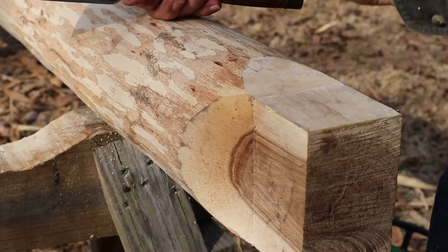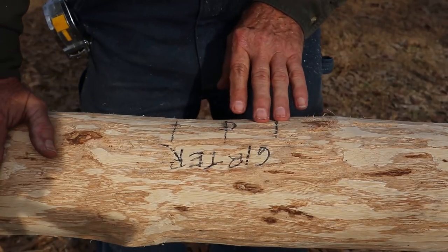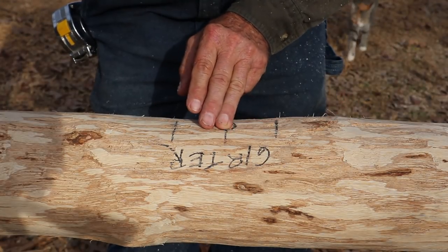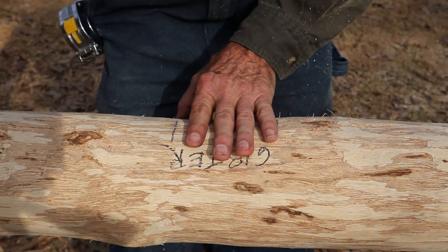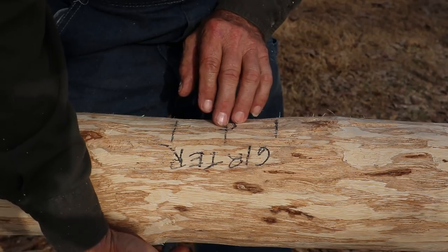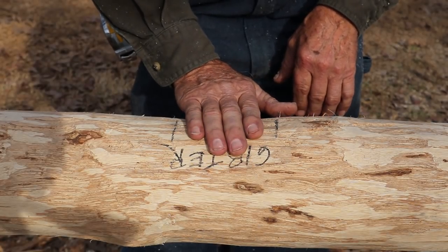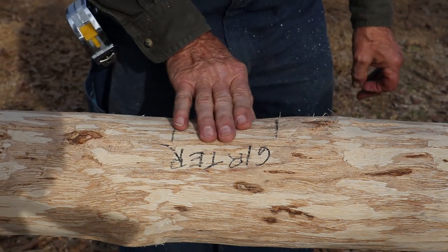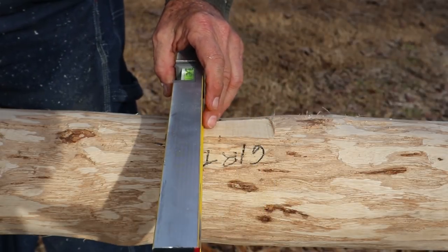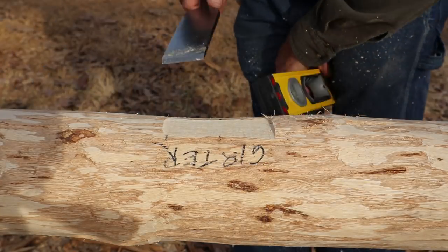We've got this tenon cut. I'll do the same exact thing on the other end and I'll have it complete. I'm going to run a girder down underneath all of these joists. The actual span will just be half of eleven feet, which would be five and a half feet. I'm going to cut a flat spot right here to set over the girder. These joists will all be different heights from the top side to where I'm going to cut this flat spot, so I'll have to shim on top of the girder to actually give support to the center of the joist. I'm going to do this with a chainsaw — set my level up there and just get a bite.